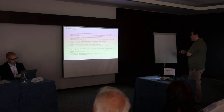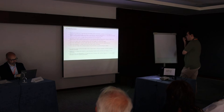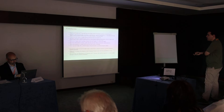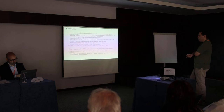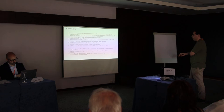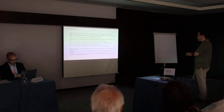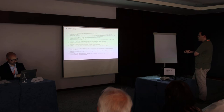Here in the 0.1 millimeter thick layer specimens, the crack propagated in a straight direction, and a lower scatter of data was obtained. So in these specimens, there was no need to print side grooves. Just to point out, one of the major conclusions of this presentation is that if you expect some irregular crack growth, like here in the 0.3 millimeter thick specimens, you'll have to print side grooves somehow.